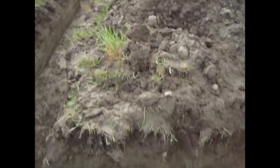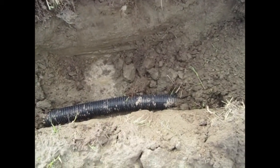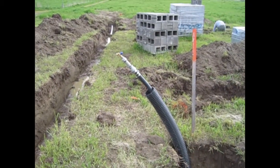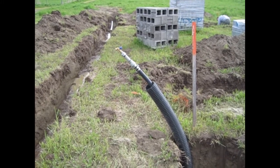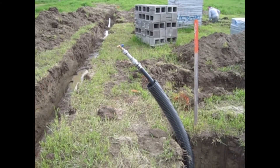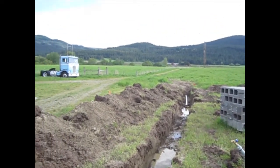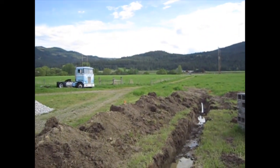The water pipe comes underground at about three feet to a corrugated four-inch pipe. That way it's sleeved, and if we ever need to, we can pull the pipe without having to dig up the entire line, which is very helpful. He also ran a drain line across our driveway where it drains out to daylight in the field.